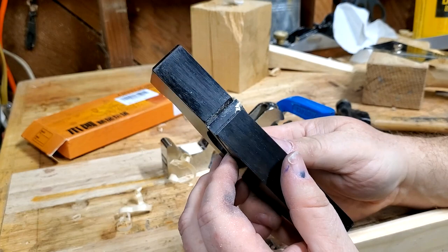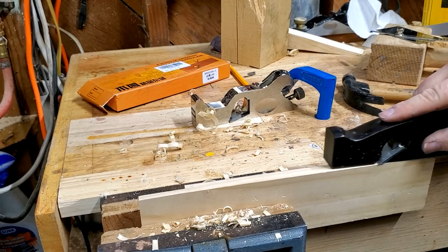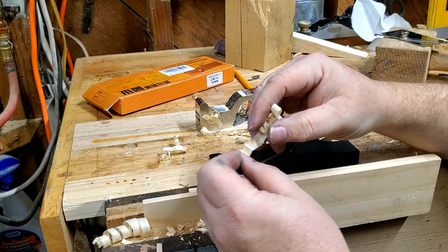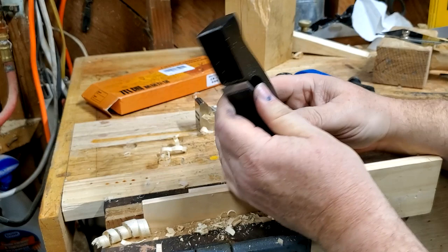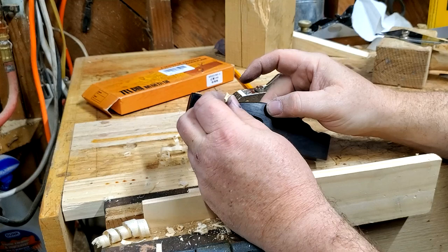I'm back from sharpening. I just put the slightest edge on it — I didn't spend a ton of time like I would if I was going to use this regularly. But we've got our piece of wood and it's definitely cutting a lot better now. Let's take a look at this shaving — it's not super thin, but it's pretty nice. It looks like I don't have the blade perfectly square. That's a little more square — let's tighten that up. Now that it's been sharpened, that's cutting pretty nicely.